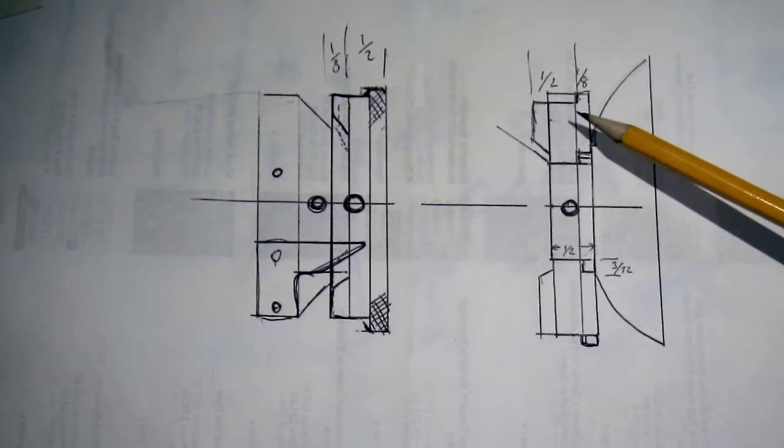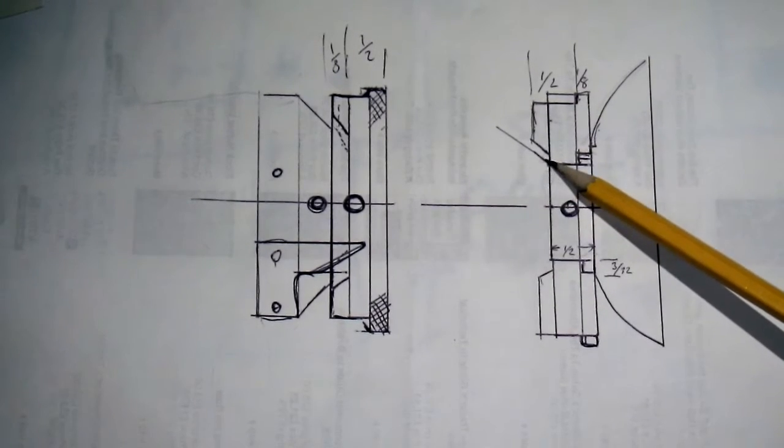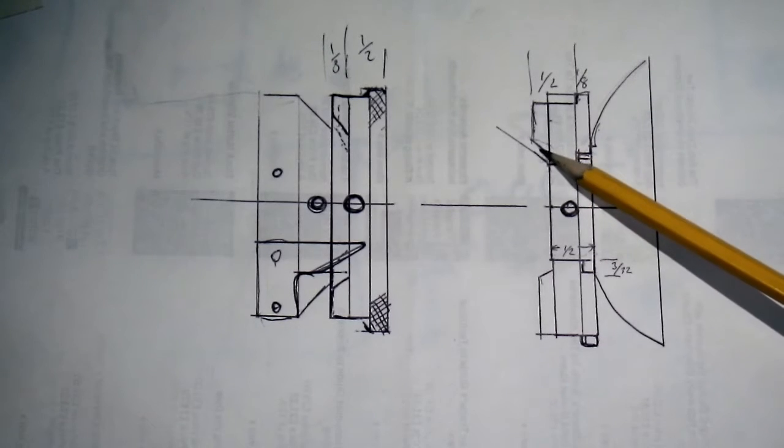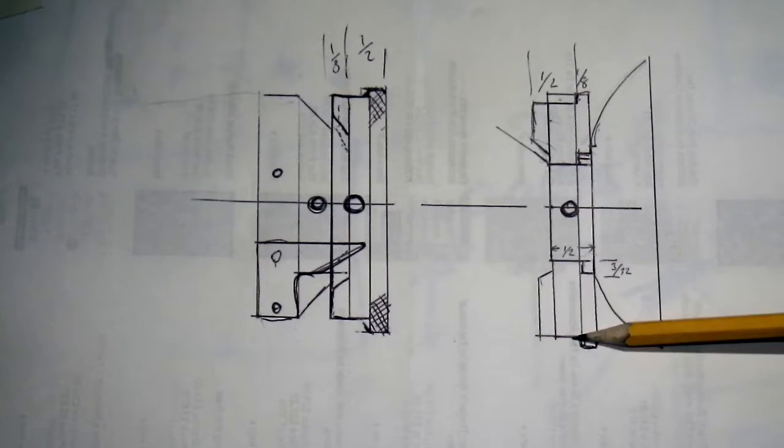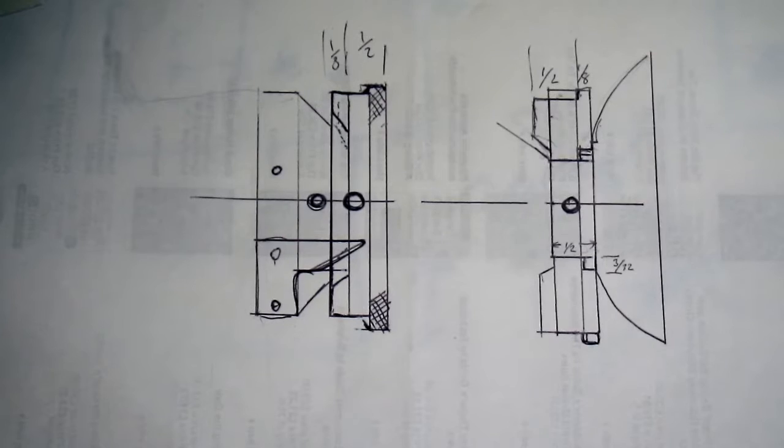So I'm going to make a ring that goes over the handle, with a bit of clearance here at 45 degrees for the tailstock. If I engrave this with increments of 2 millimeters, because from the test we did one turn of the handle is roughly 2 millimeters, that will give me a better guide than the current engravings on the tailstock.